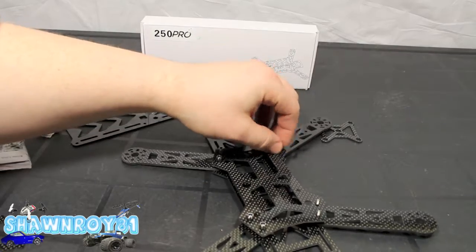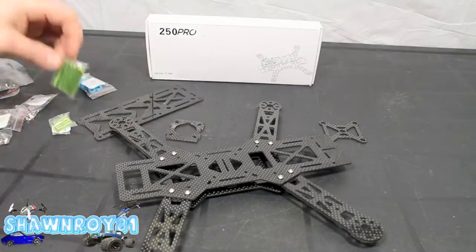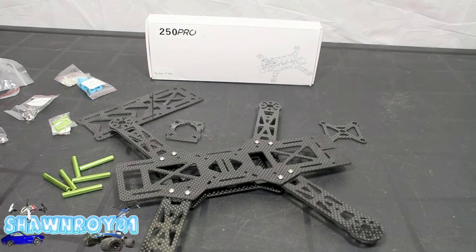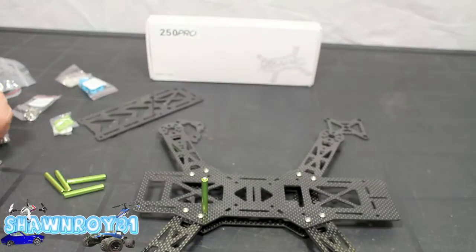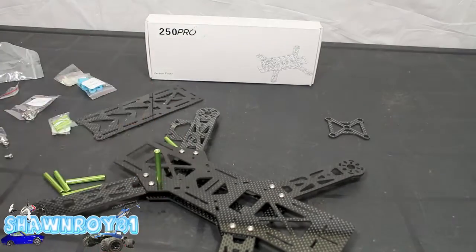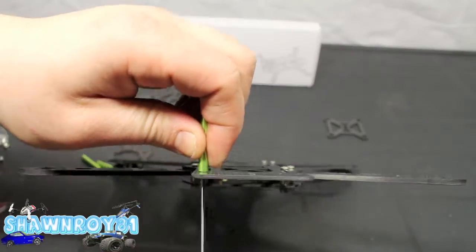That portion is done. Now we move on to our aluminum posts — we have six posts, and it's very simple to see where they go. We only have three pre-drilled screws for that. As I always tell you, anything that's going metal to metal, get some threadlock on there. I threw some duct tape on my pliers so that when I grab onto those posts to snug them up, I'm not scratching them — fuel tubing or anything you can throw over them will help.